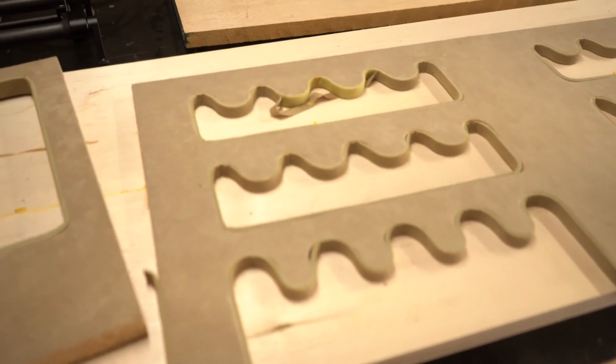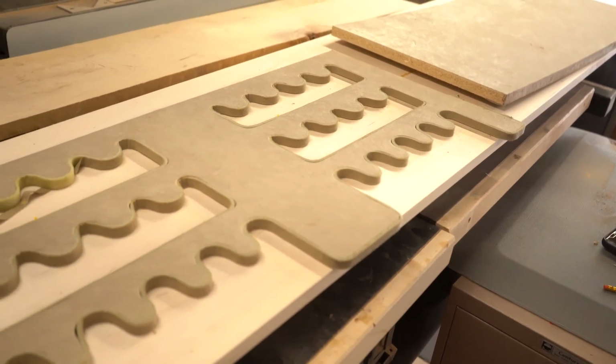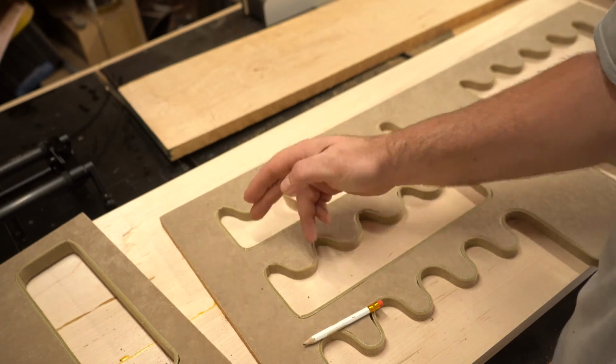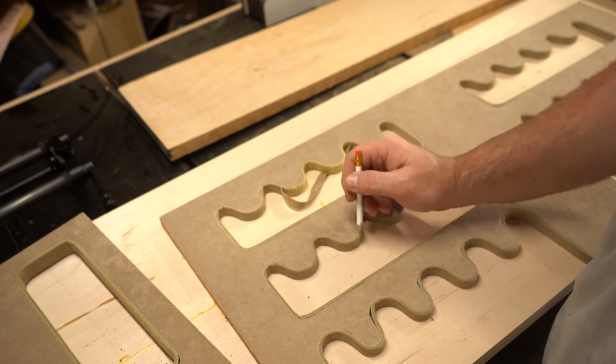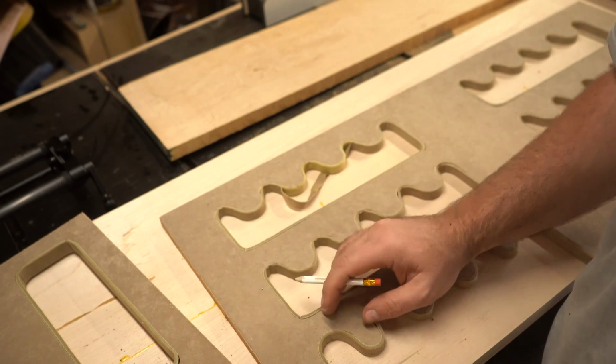The existing particle board shelves have felt on the top, and the rifle notches are also lined with felt. I have to remove the felt so I can later use the pattern bit and make an exact replica. I'll end up tracing the old shelf out and using that as a template for the new shelf.